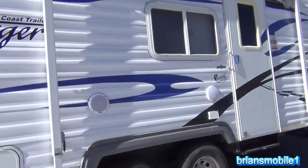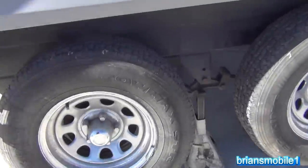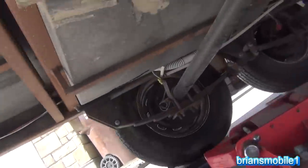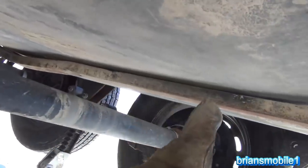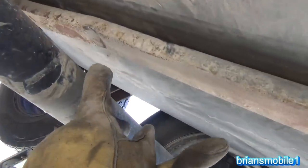Today I'm working on this trailer. I've got the axle supported with jack stands — one in the cross and another as back-up — which frees the jack up to work underneath. The primary complaint is that the water tank is hitting the axle. That happened after these ribs just got bent to snot. You can see they were actually on the axle — total failure. There's a little bulge in this one too.